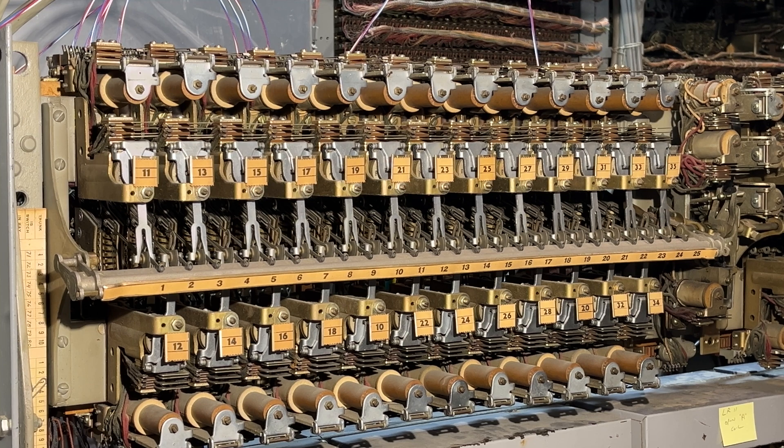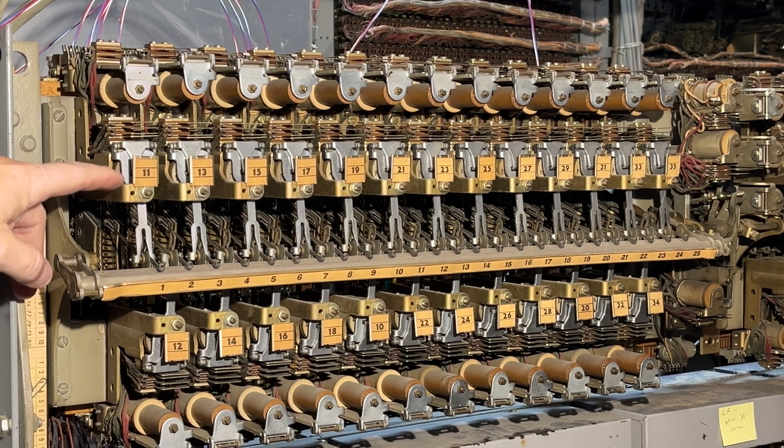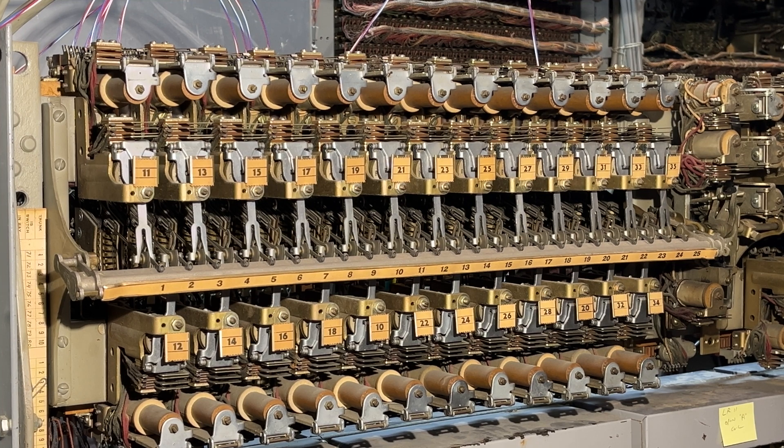When I go off hook, we're going to see the first plunger switch — which they call number 11 but in reality it's number one — plunge into the bank. I'll show a close-up of that momentarily. The master switch is rotating the bank, or the plungers, up and down in an oscillating motion. I don't know if that was normal when all 10 outlets were busy; unfortunately there's not any documentation that I have available yet, though I'm working on it.